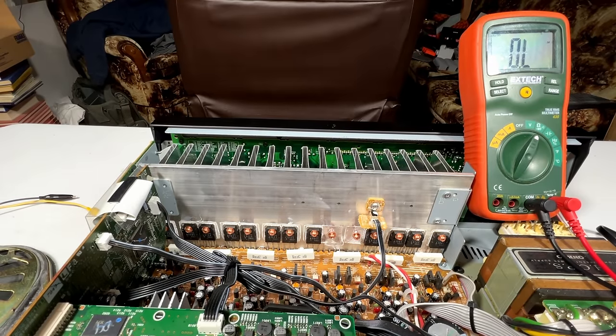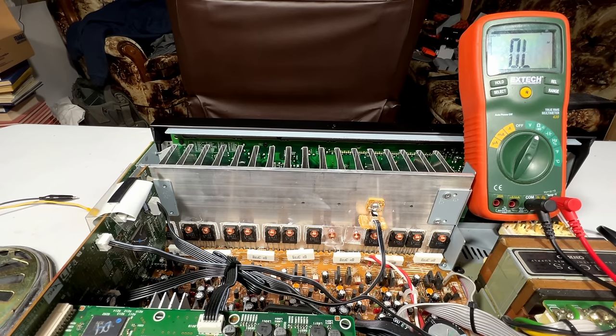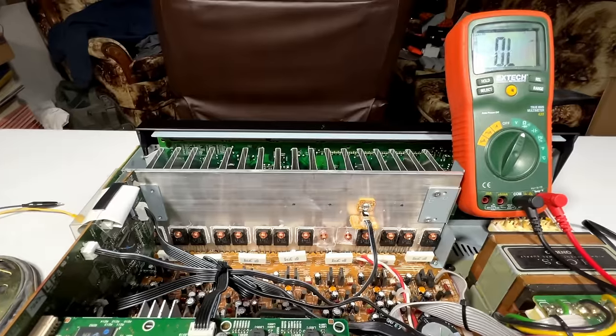That might be the bad one right there — yeah, 0.57 ohms and zero ohms. But the other one tested good in-circuit, so let's try that. The left channel is working properly, passing audio, no DTS chip errors at all — that's all I needed to know to get some parts ordered. I would say I'm surprised I forgot something important, but I have so little experience with this type of equipment that I'm not surprised I did forget something important.